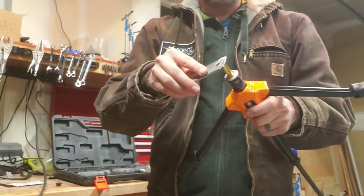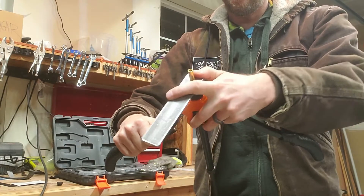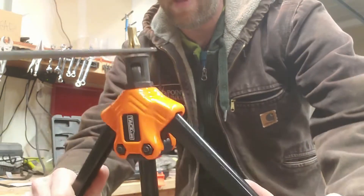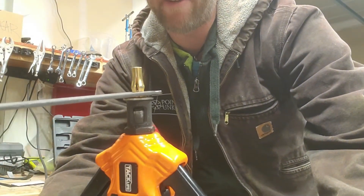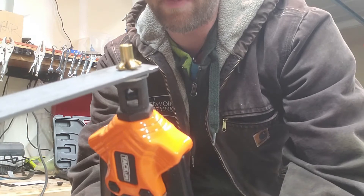It's a pretty simple operation. I just put on my piece of metal and start pulling the bars back. You can see almost instantly the PlusNut kind of forming around the hole as I pull it back. It keeps on forming until it brings all the way in.